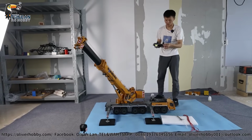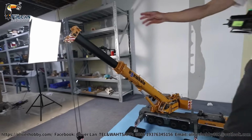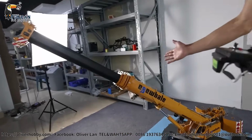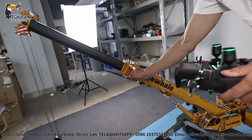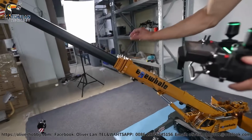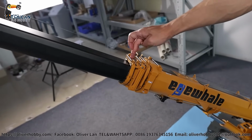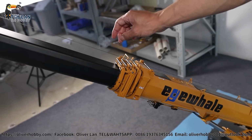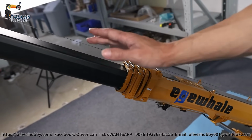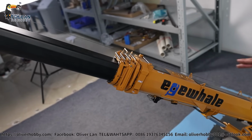Reaching out, wait for it. So now the first arm is going out, the pin is locking for this rear side. Locked with the piston inside, lock pin and pushing. Wait here. In position, pin unlocked. And lock another pin, this arm to the second arm. The pin is locked, and the piston from the first arm, the pin is unlocked. Now the piston goes back to lock the second arm rear side.